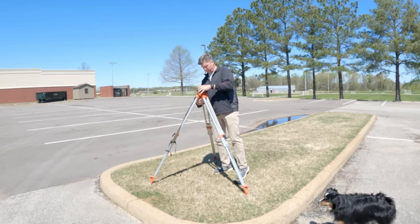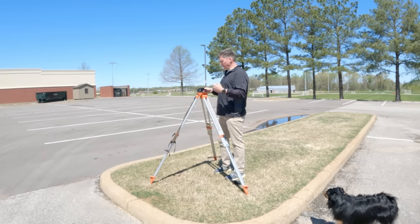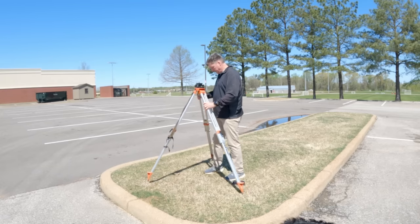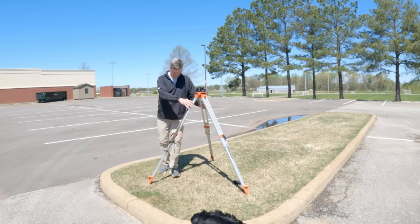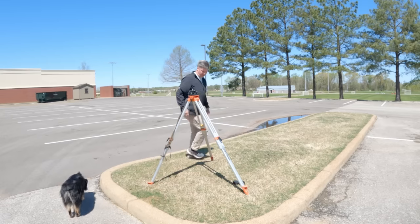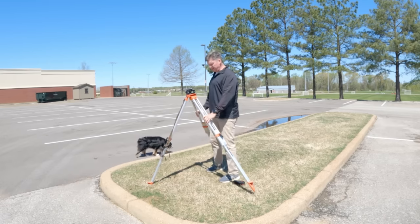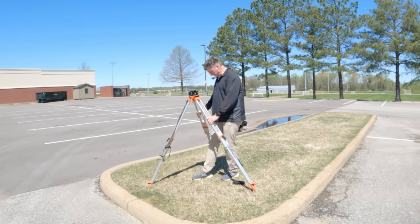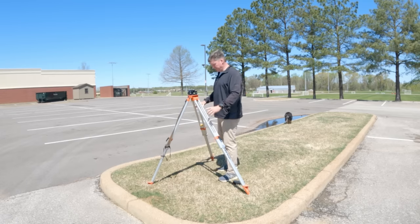to see your benchmark. And so what you want to do is, I'm going to turn my laser on, and I get it to where it's pretty level, right? And so I come and then I get it to where it's kind of set up. I'm going to have one leg that's mashed in the ground. Now what I'm going to do is I take these 2 feet right here, and with that laser, if I can find my laser, where did my laser go? Oh, there it is. Okay, now I move these 2 legs until that laser is dead on.